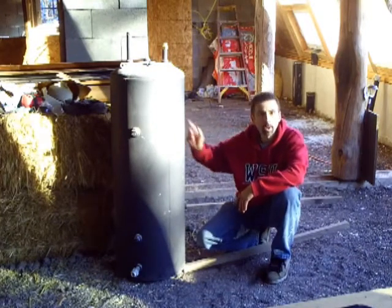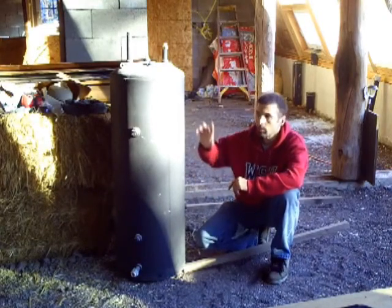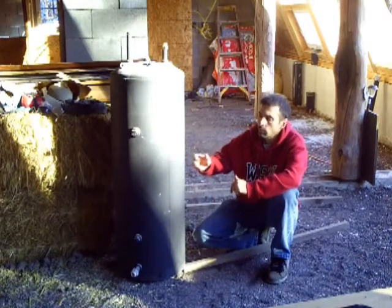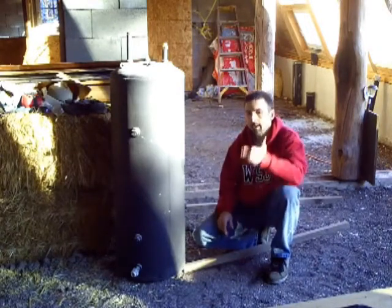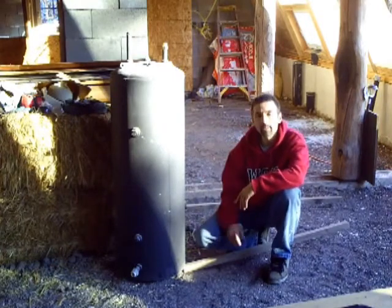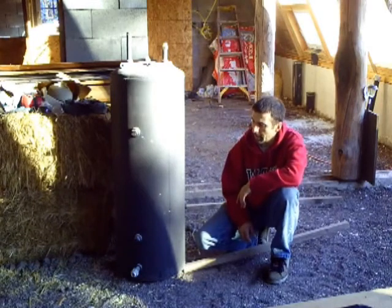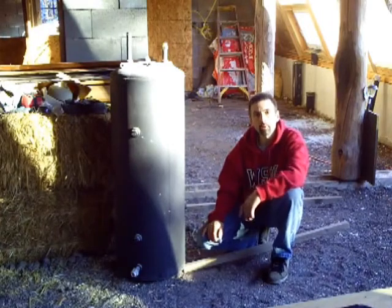The other tank is going to feed right to the master bathtub — my wife Lisa loves to take baths, so I'm going to put a tank up there. This one will not be under pressure; we'll simply fill it with water until we see water come out of the overflow, then shut the water off. It will heat up, and then we'll open a valve by the bathtub and it will drain by gravity into the tub. Anytime the sun is out or has been out recently, she will have 40 gallons of piping hot water costing zero utility bills, zero electricity, zero fuel — a very inexpensive way to use the sun to heat your hot water.